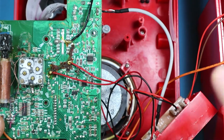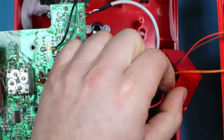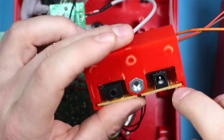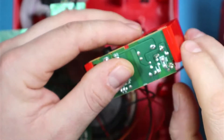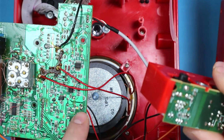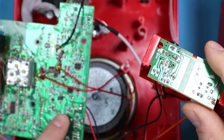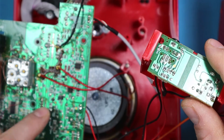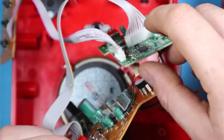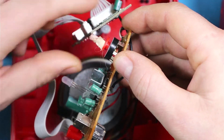One thing I think might have happened: it says six volts but the DC jack is the regular two and a half millimeter DC jack. What I think might have happened is that someone tried to plug in a 12V adapter and somehow that might have destroyed some of the components. So I'll need to track how that power is distributed on the board and see if we can find anything that might have blown up. This here might be some voltage regulator. And here on the end we have the power switch that turns on the power and then regulates the volume with this potentiometer.